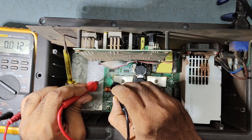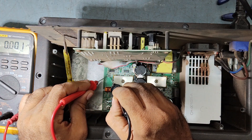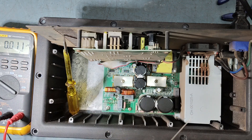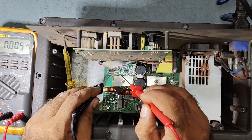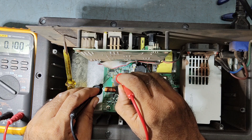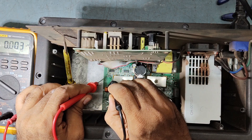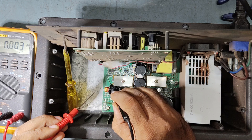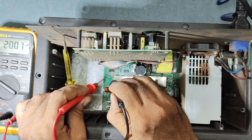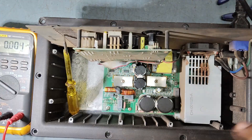See here — voltage is dropping. I must get over here more than 80 volts, but it's coming and going, fluctuating. I think the problem must be somewhere here. On this diode terminal I must get around 70 to 80 volts, but the voltage is dropping and fluctuating. So what we will do is put it off and check with the ohmic test.